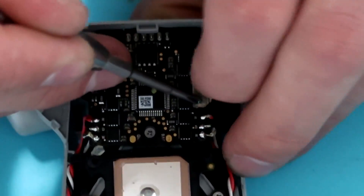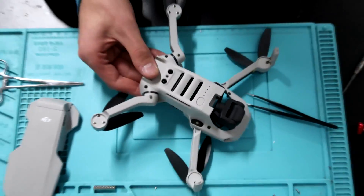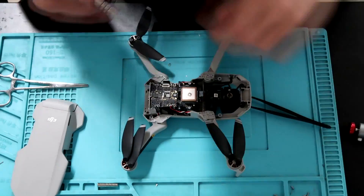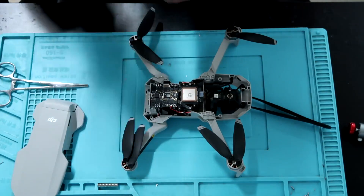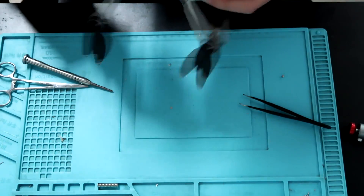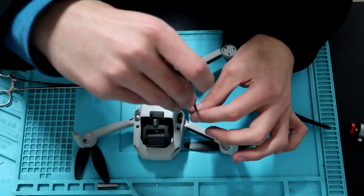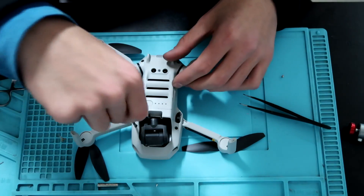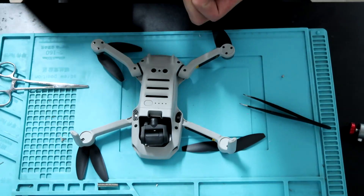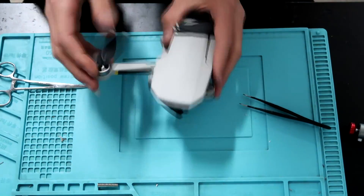Going to seat that ribbon cable back onto the 4-in-1 ESC, make sure it's completely lined up. If you guys want a more in-depth rebuild video let me know and I can totally do that. We got the last step — putting in those two screws for the bottom plate and seating the top plate back on, and we're wrapped up. The Mavic Mini — a pretty simple teardown. Hope you guys enjoyed this and learned something. If you're interested in seeing it fly, go check out our other videos. It's been DJI drone service — I'll see you in the next one.